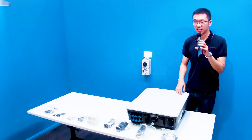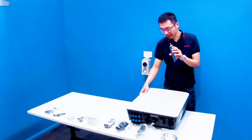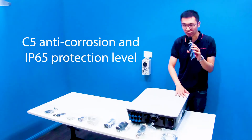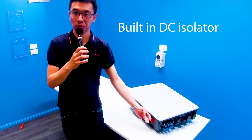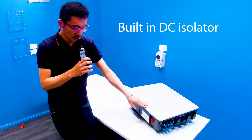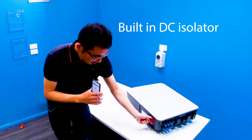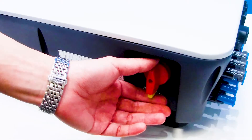The first thing I want to emphasize is this inverter enclosure. It is made from aluminum and has an IP65 protection level and C5 anti-corrosion protection level, so this inverter can be installed for coastal and outdoor installations. The second thing is this hybrid inverter has a built-in DC isolator. This DC isolator can comply with all relevant standards in Australia. In particular, this DC switch is lockable — as long as you press the yellow button, you cannot switch the DC isolator.